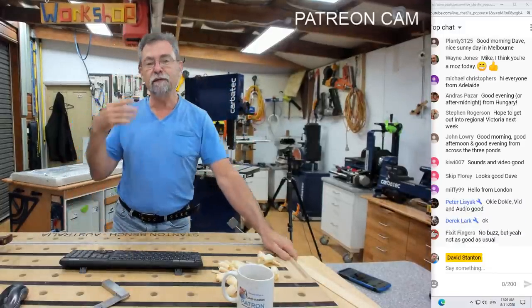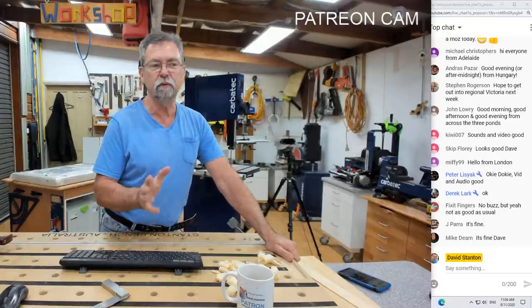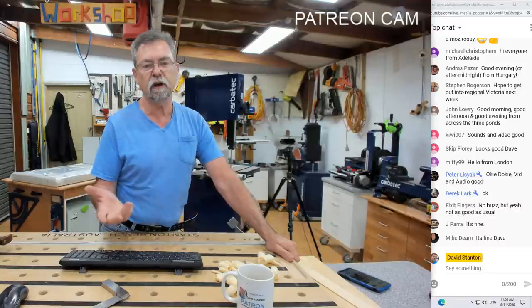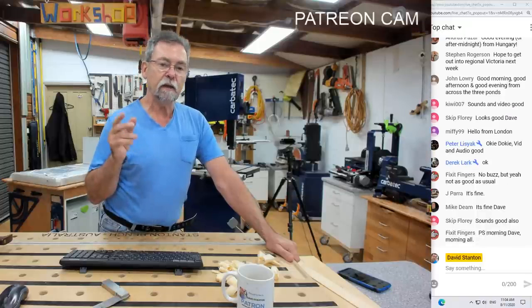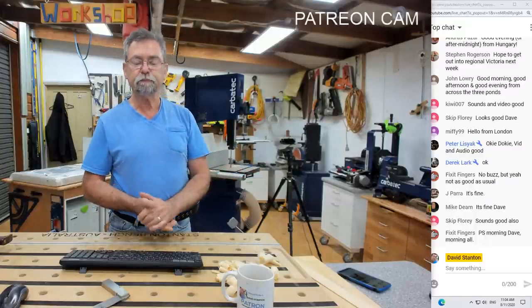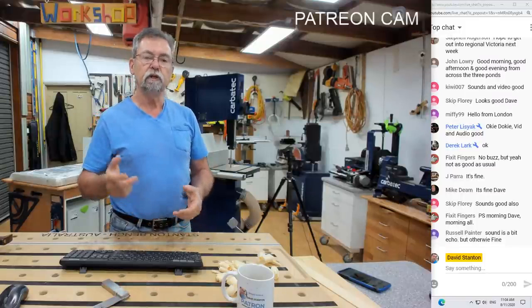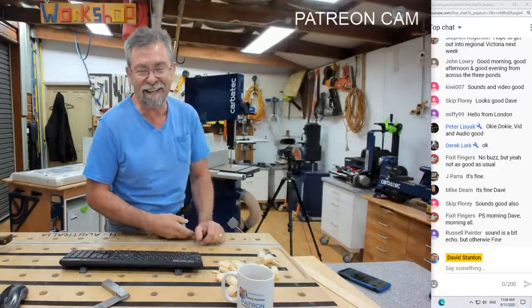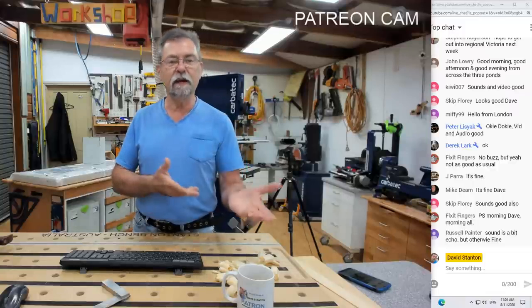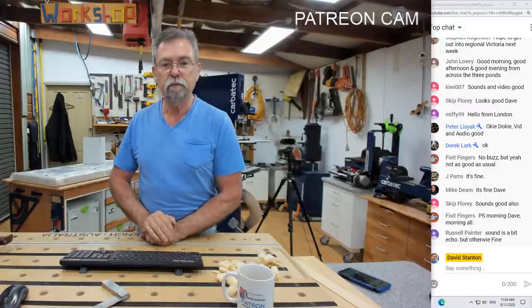Today on the show, I'm going to offer some alternatives to thin rip jigs. Now, you can buy these things, and that's fine. If you want to buy a thin rip jig, you can do that. But I can get you out of strife by using one of two different methods. One method is a mag jig: my featherboard, I just turn it around the other way, and I'll demonstrate that, lock it down. A lot of people don't have a table saw that's got the capacity to put something that's magnetable. Is that such a word? They don't have a cast iron top, they'll have an alloy top that magnets just don't work on. So I have another system for that.